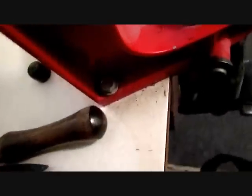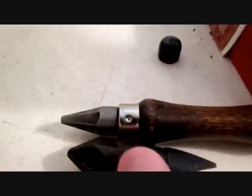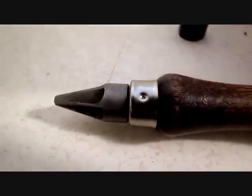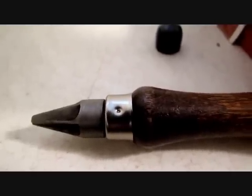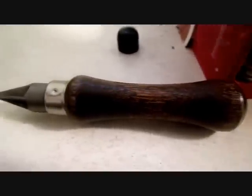Here's an example of a VLD taper one. If you notice the taper angle on these two different tools here, this one's a lot stubbier, this one's got a sleeker angle. This one is made for VLD shaped bullets, the longer, sleeker bullets. It'll give you more of a taper so that it's less likely to chafe off some of the jacket of the bullet when you're going in there. So that's kind of nice to have for the long range shooting guys. That's what I use actually for the insides of the case mouth there. This one I use for the outside.